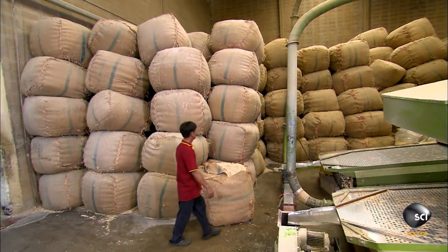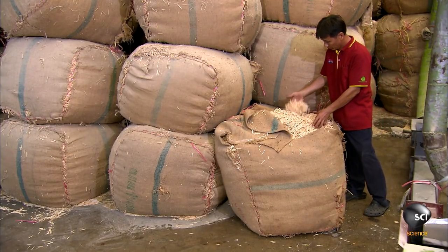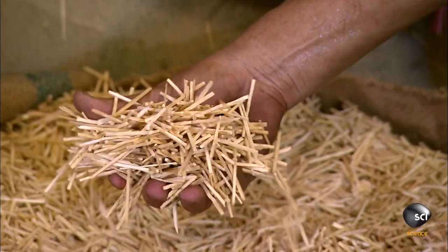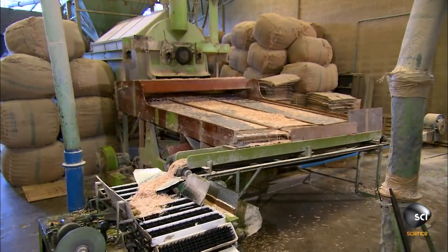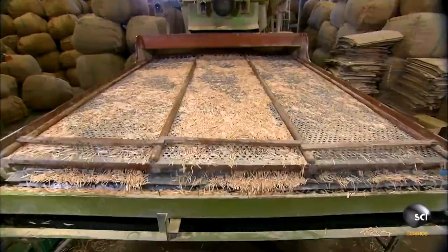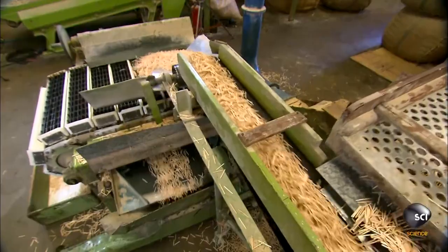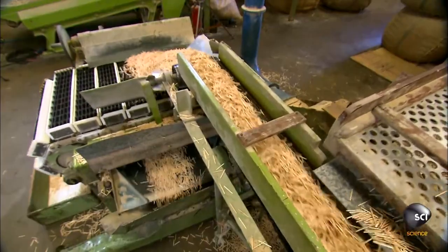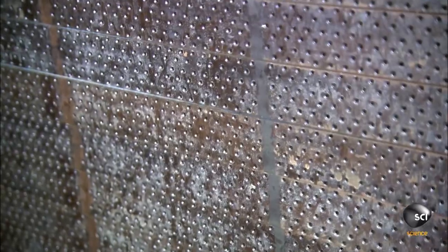On the splint production line, a worker inspects a batch of splintered aspen wood, impregnated with ammonium phosphate to prevent afterglow. The splints run over perforated plates to shake off any residue or waste. Then they go through a machine which automatically discards broken or undersized splints. The splints now reach the match dipping line, where the perforated steel match bar runs down an endless chain.